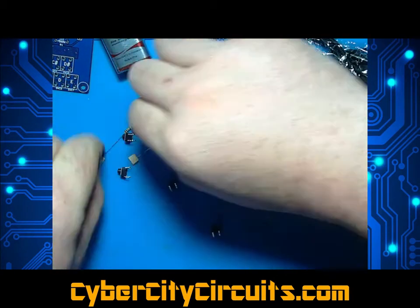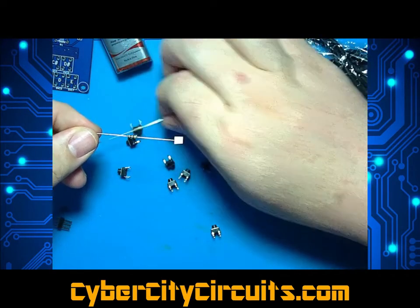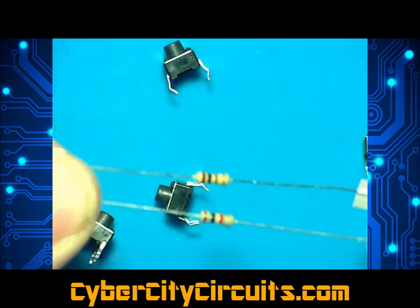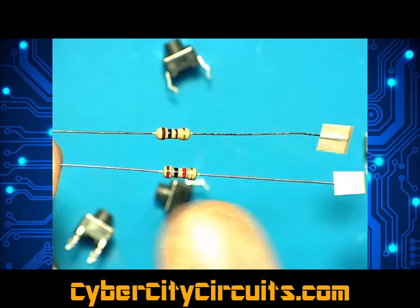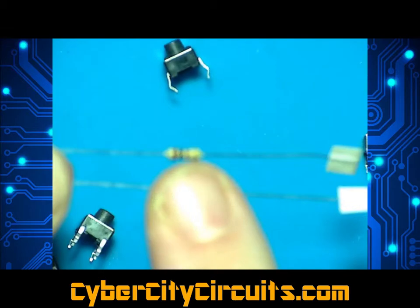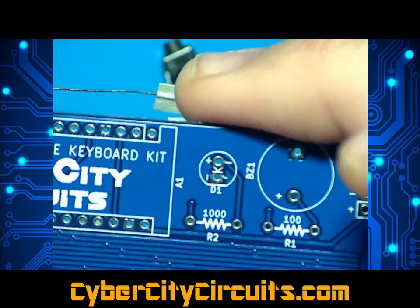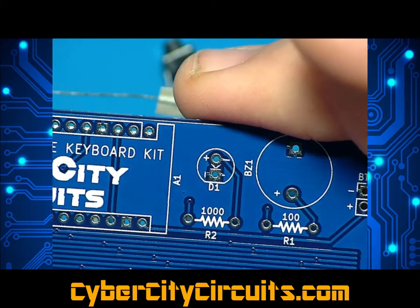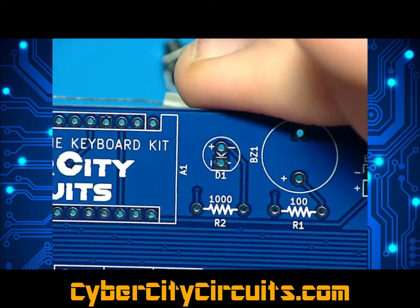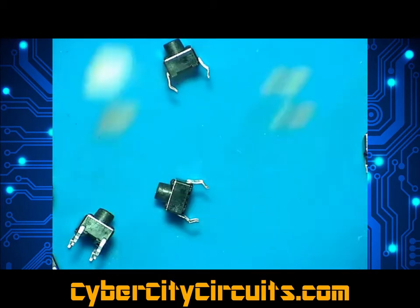We got some resistors. There's two different kinds of resistors here. There's a 1000 ohm and a 100 ohm. Let's zoom in a little bit and we'll see a little bit more about those. So the 1000 ohm is brown, black, red, while the 100 ohm is brown, black, brown. And that's important because later when we use our board, you see there's a 100 on the board. That's where your brown, black, brown is going to go. And then there's a 1000. And that's where your brown, black, red is going to go. So let's not get these mixed up. You're going to have trouble if you do.